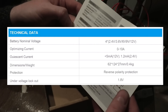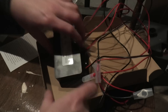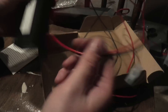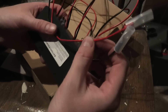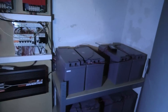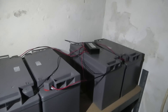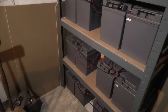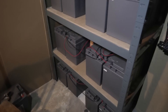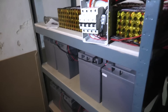It seems to be doing a good job. I'm going to be mounting the last one - the wires are just about long enough if the batteries are not too far apart, and the manual says the wires should be good for 10 amps. Now there is a battery equalizer on each of my five remaining battery banks. I think the batteries are still pretty useless but I'm giving it a try - it's a lot of batteries to just trash.